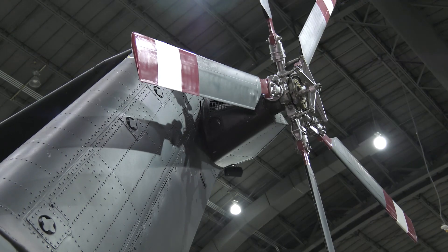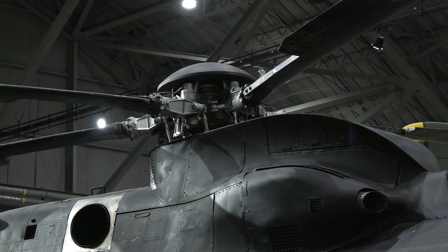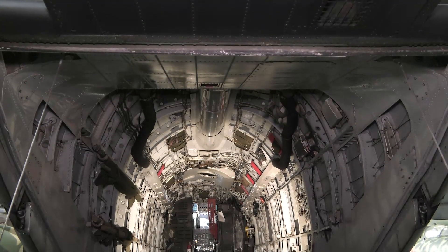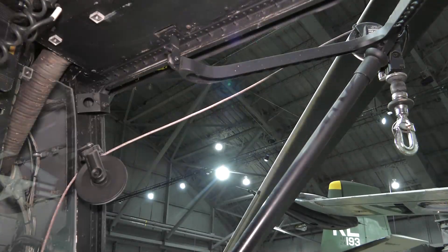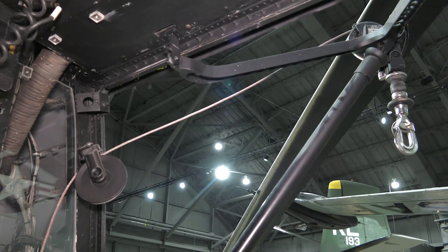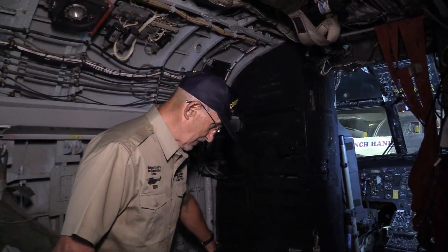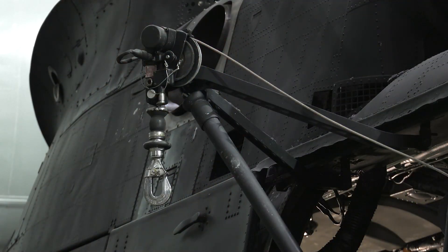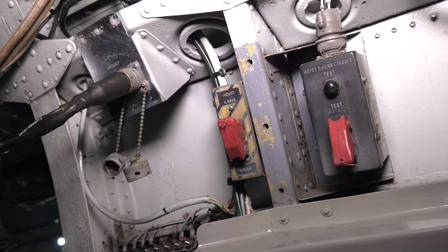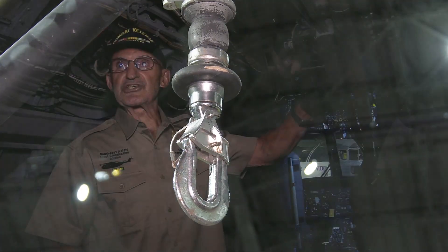I love this airplane. It's one of 10 that we had, but this airplane had notoriety just because of its name and how it was painted — flat black, that's how they painted it. So a lot of missions we flew on it. This is a makeshift hoist. This pre-position hoist in the door was an add-on way back in the day. This is the cargo winch — we'd run the cargo cable through these pulleys out to this hoist and use the forest penetrator if we had to pick somebody up on the ground. But it only operated at 50 feet a minute. The airplanes over there with the hydraulic hoist were 250 feet a minute — we never had it on these early airplanes.